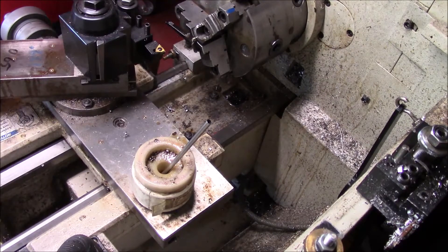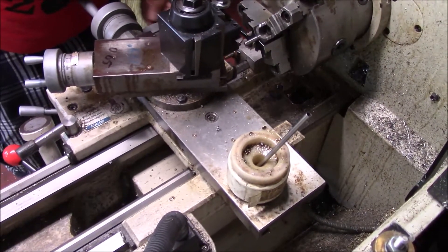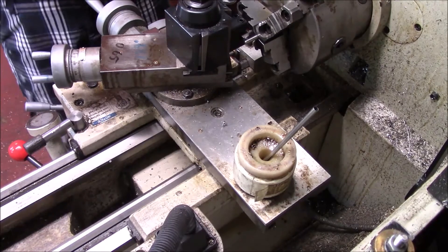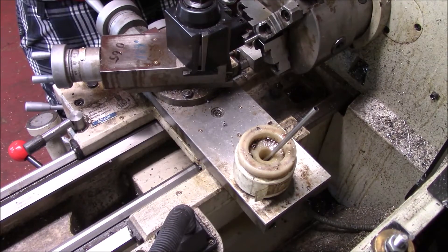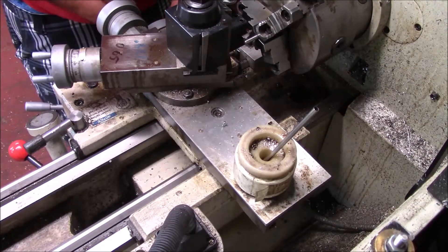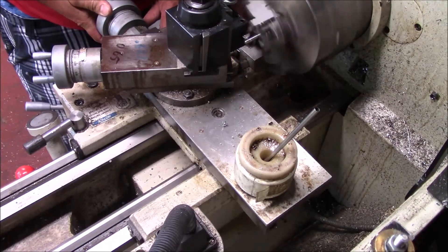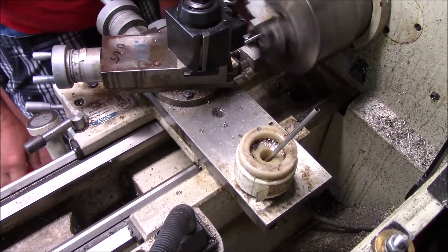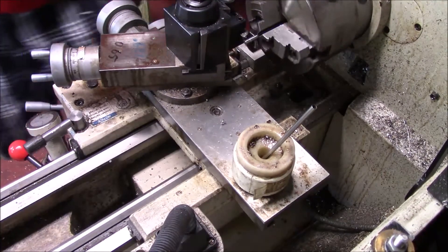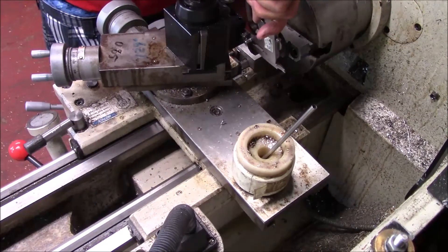I've got to go back and start all over and cut a new rod. That means start all over. One problem I have is I really just don't have any grooving tools. So I went over in the box and got a bunch of high-speed bits I picked up off eBay a long time ago, just for emergencies. I've ground up one of them — it was pretty tall — done a quick grind on it, and I'm going to make a relief tool. I'm going to make this relief sort of round. I'm shooting for about 180 thousandths OD in the bottom to give me a little relief.